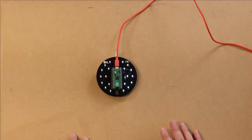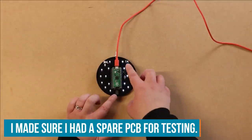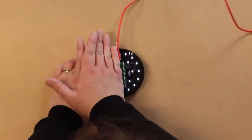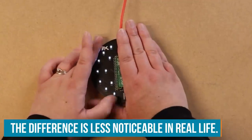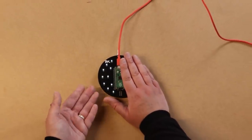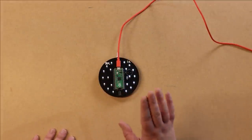I really thought the 510 ohm resistor was going to be too bright based on the datasheet, so I took one of my PCBs and populated one half with LEDs with 1k resistors and one half with a 3k resistor just to compare. The 1k looks good — it's nice and bright. However, 3k actually looks pretty much the same; you can tell it's a little less bright but it's still quite pleasant and nice to look at. So I'm going to go ahead and populate the rest of my PCBs with the LED and 3k resistor combo.